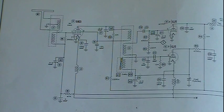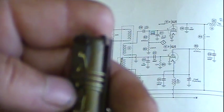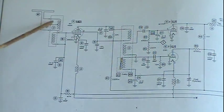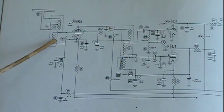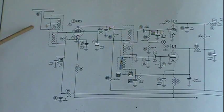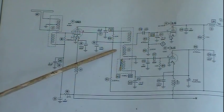But since it's a TV and it is a clunker type, what you're doing is each one of these for the 213 has different windings on them to fit those frequencies. So that's what you're doing. You're putting in different coils in here that are of different inductance. But anyway, the signal comes in, gets coupled, goes into the grid, and is amplified.